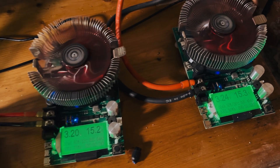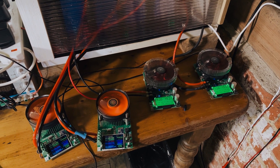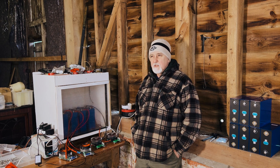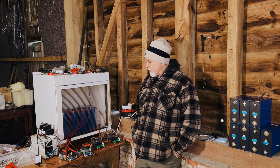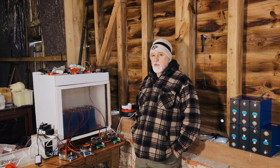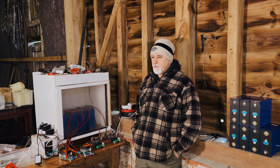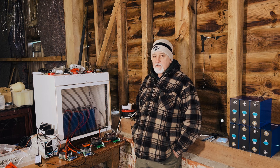Tests are going — one, two, three, and four. This will take roughly 20 to 21 hours to complete, so tomorrow around about this time. Hi folks, the capacity tests have completed. We started them at about three or four o'clock yesterday afternoon and they finished one or two hours ago. We ran them at 15 amps until they all reached at least 300 amp hours. Remember, these cells are rated at 320, so at 300 we turned them down to 5 amps, which causes the voltage to bounce back a bit. Let's look at the testing rigs and see what we've got.